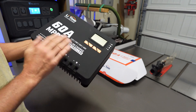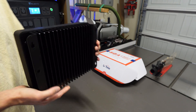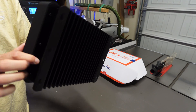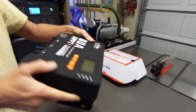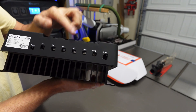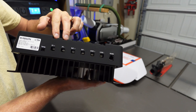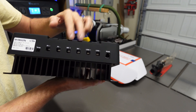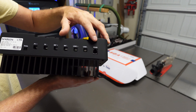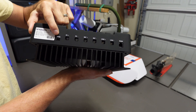It's got a soft touch coating on it. You've got your LCD screen up top and a huge heat sink. The ports on the bottom look like they'll easily accept up to at least 10 gauge solar cables, battery leads, and loads if you want to connect a 12 volt load. Your two PV cables go on the far left, battery cables in the middle, and loads on the far right. You've also got an RS-485 communication port on the right side and a temperature sensor port on the left.